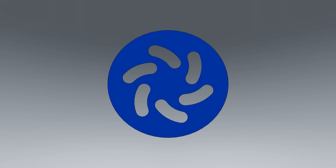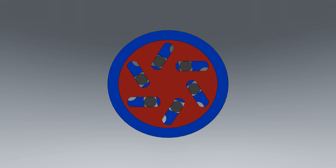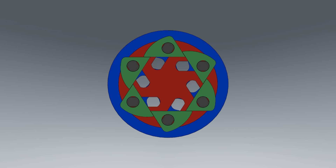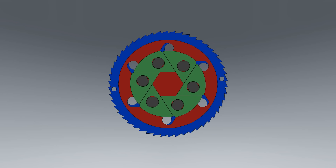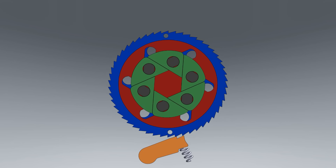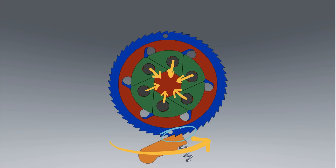To make this work, I need to convert rotational motion to linear motion clamping down on the bolt. Here's how I did it: opposing plates and spring-loaded pins. As the blue plate rotates, the pins drive inward, tightening the grip. Add teeth to the pins, and suddenly we get something that resembles an adjustable wrench. But I still need the wrench to ratchet. To do that, I added a spring-loaded pawl. As the spiral plate moves forward, the pawl slips past the teeth freely, but when you reverse the motion, it catches immediately. Apply a force to the handle, and it's transferred through the blue plate and onto the bolt, increasing the grip as more force is applied.